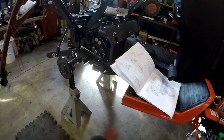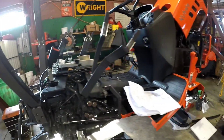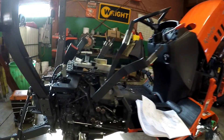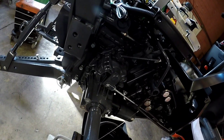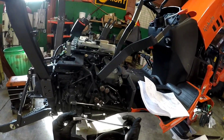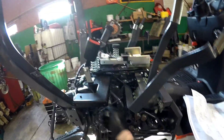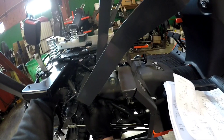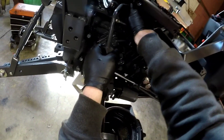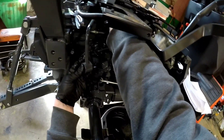Next step - we're going to get this gray pipe off and replace it with the one provided, and a new fitting for right here. If you are watching this video and doing this yourself, make sure this three-point hitch lever is all the way down because you might get more fluid than you bargained for. There's a 26 millimeter right here. I'll just get this little wire out of the way and block those holes with my middle finger and thumb to keep any more fluid from leaking.